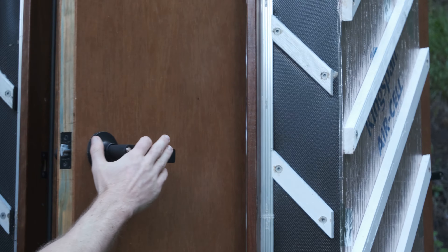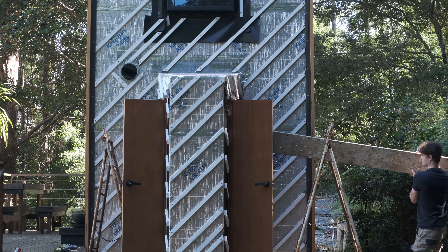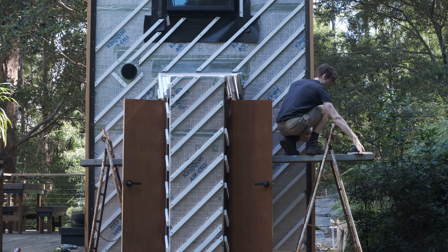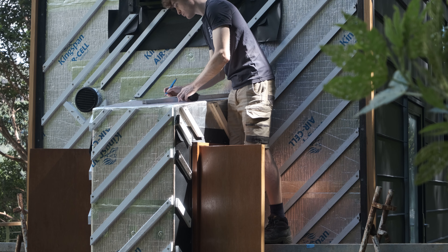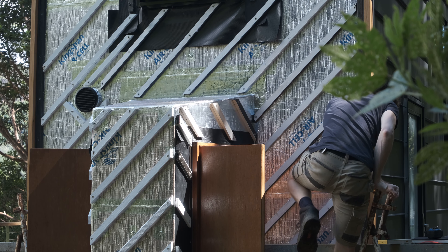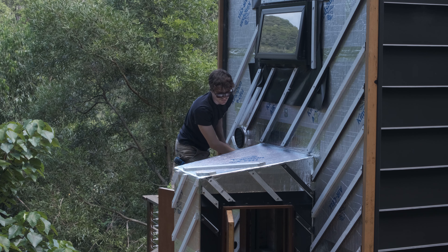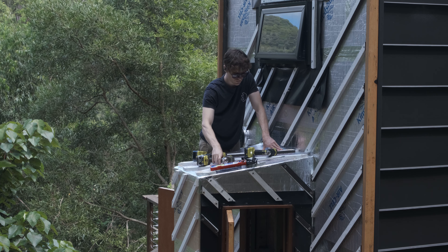What you're about to see is a happy accident thanks to putting two doors on the utility box on the front of the house. I knew I'd run into issues trying to use my trestle to build this wall so I was expecting to mostly be on ladders, but luckily by opening both doors I can just run the walkway through the house. The placement of the battens might look a bit irregular in some spots, but thanks to experience on the other walls I came to know where I would need material for future flashings and clips.